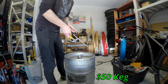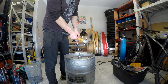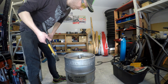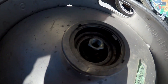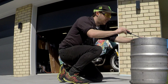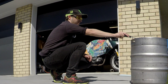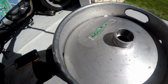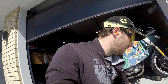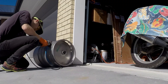I've heard these gas bottles can have residual pressure, so before I cut into it with the angle grinder let's see if anything comes out — and yes, there is pressure in there. I've got a nut on there with a wee lip and I should just be able to lever it and release all the pressure. Now I'm going to wash it out and get rid of all that stink out of it so it's nice and clean and ready to modify. After a wash I'm going to mark my cutting line and cut it open.